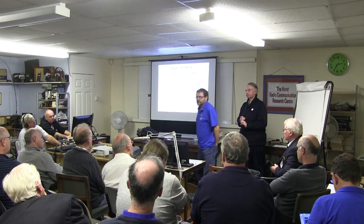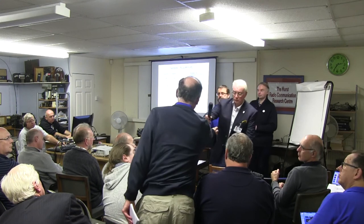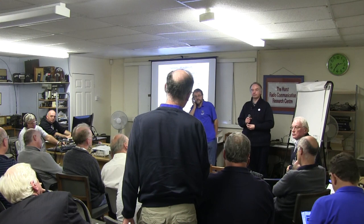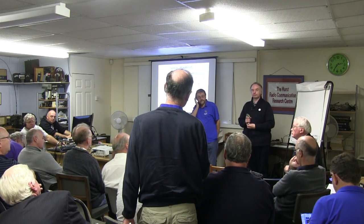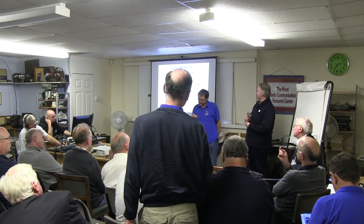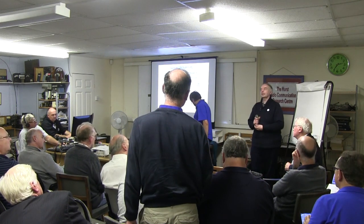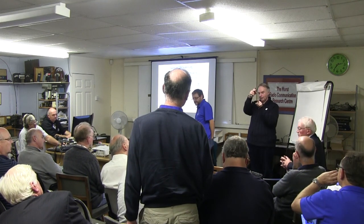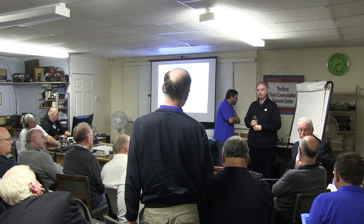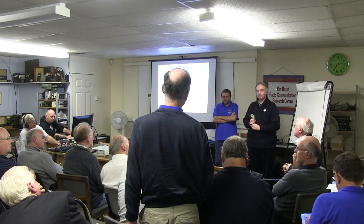Okay. Any more questions? Oh, Sean's got one. Sean, G8VPG. Can you confirm what the local oscillator input levels should be for 437 and 146, please? Yes, I don't think I've got it on this display. No, I haven't got that slide up. If you look at the data sheet, it shows you levels at an upper and a lower limit. So minus 10 dBm for 437 megs, and about minus 18 for 146 megs.